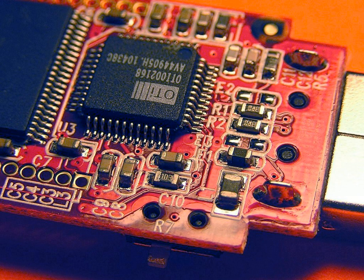Topic: Dual inline. Flatpak was one of the earliest surface mounted packages. Small outline integrated circuit SOIC, dual inline, 8 or more pins, gull wing lead form, pin spacing 1.27 mm. Small outline package, J-leaded SOJ, the same as SOIC except J-leaded.